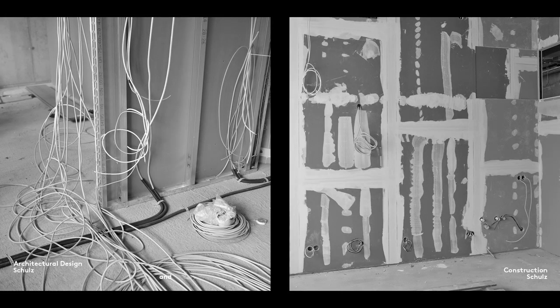The practice of chasing a channel or rebate into a finished concrete wall is reserved for exceptional circumstances because it is expensive and may result in damage to the cable sheathing. With plasterboard stud walls, electric cables are laid in the cavity between the two plasterboard skins. The framework is constructed and one side is sheeted out so that the cables can be run in at floor level and fixed in the cavity. When the second side is sheeted out, holes are provided for the subsequent installation of switches, sockets and outlets.